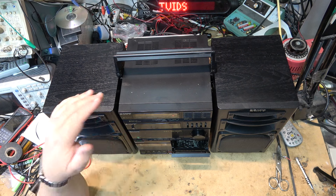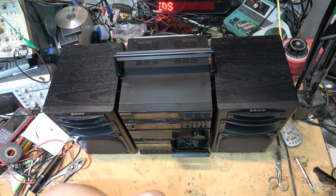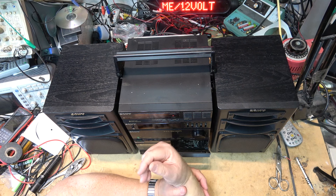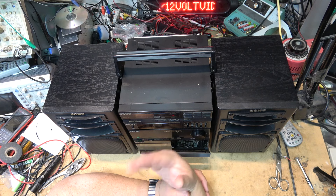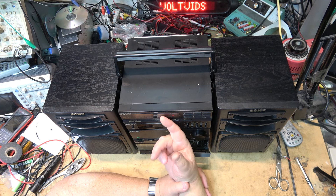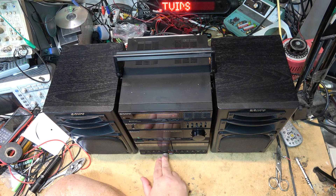A lot of these LED strips or even basic LEDs don't emulate the exact color that the incandescent bulb did. Many people want the original incandescent bulb replaced because of aesthetics and no hotspots. The problem with LEDs is they're directional, so they tend to have spots that are brighter than others. Sometimes you can mitigate this by facing them the other way and reflecting off the reflector in the back, but other times they just don't look right.